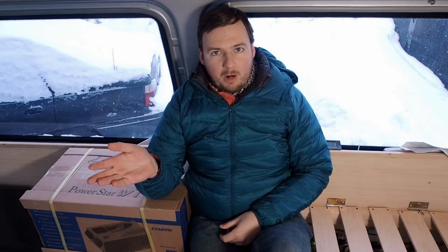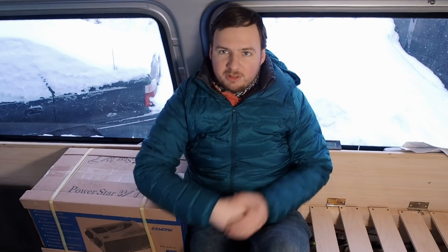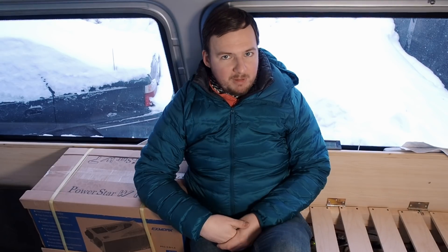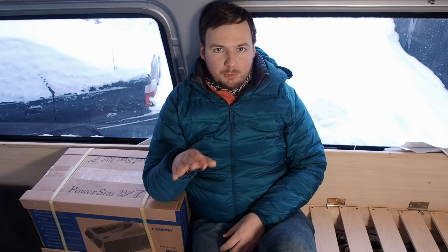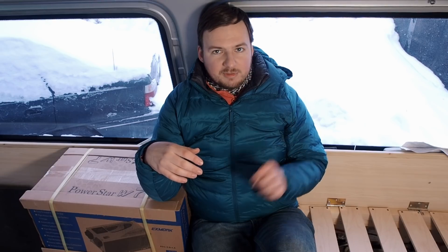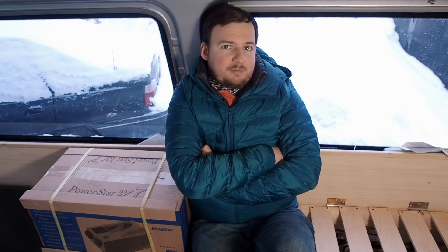You can get a really good small generator, about the size of a briefcase, making decent power — about 1kW. But the problem is it produces AC power, and you can't just plug it directly into your batteries. You need a DC battery charger. A small car battery charger costs about $20–40, no problem. But a big charger with 30–40 amps costs about $400, which is expensive. Then I found another option: you can get not just a battery charger, but an inverter with a battery charger built in. It's still about $400–$500, but it's a really great thing.